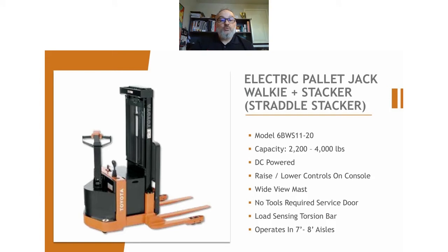If you're going into heavier weights or need to go higher, then you're going to go to our industrial model, the 6BWS. That's going to have a capacity up to 4,000 pounds. This one will have a mast height of up to 189 inches, which is more of a traditional three-stage mast that you would see on a forklift — allowing you to go three high, maybe even four high depending on how tall your pallets are. It can operate in a seven-foot or eight-foot aisle, so it's still a little bit better than your conventional stand-on reach truck. Comparing it to the Class 2 stand-on reach truck, this is going to be for lower volume where productivity is not the main thing — you're just looking to get heavier stuff off the ground and into racking.